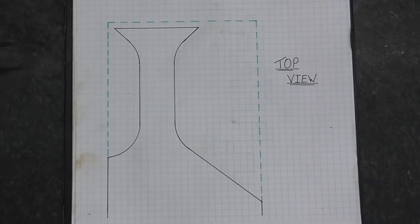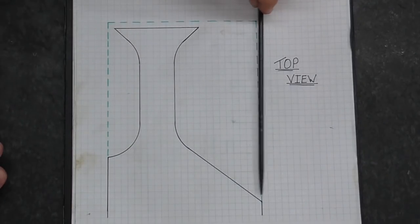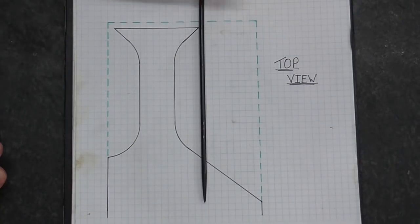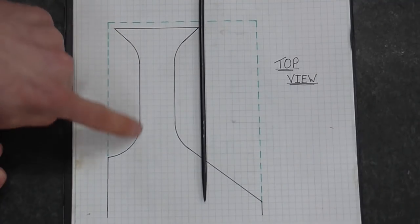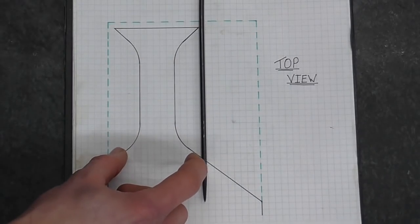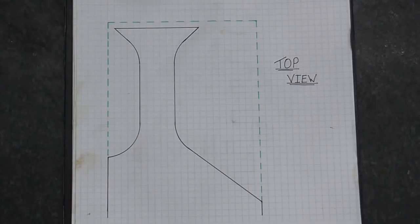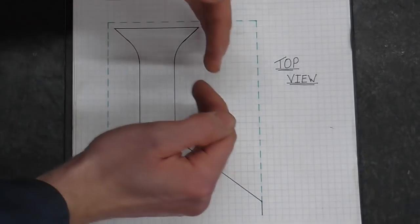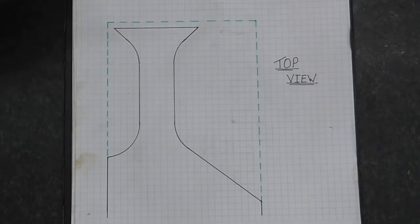And what had gone wrong the first time round was I started by doing this end face and taking the tool to width by blocking this out, and so I'd basically given myself the starting corner and I was going to just put the clearances in from there. Now, because I had already taken this to finished width, what happened was as I started fiddling around with these angles, getting everything right, the grinding had nowhere to go but further in and further in. So I ended up with a tool that was too thin and I decided to start again.